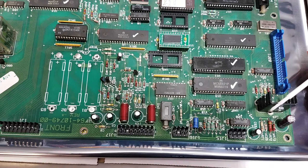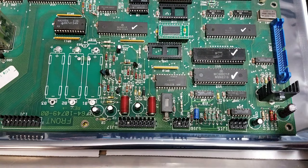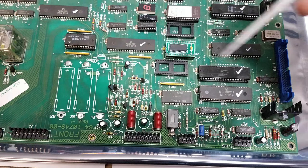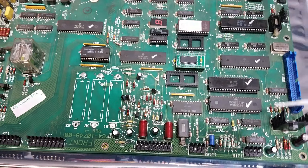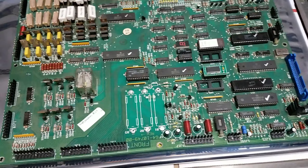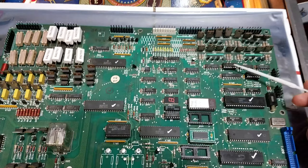Since I couldn't get Leon's sound test to run properly, I put a good sound PROM from Space Shuttle in and tested the sound section of this board in Space Shuttle — it worked fine. The general diagnosis for cross-connected boards says at least one PIA of the five will go bad, so I figured since the other four tested good, this one was likely the casualty. The 7447 also died — I'm assuming that was part of the cross-connection — and U41 died from a previous tech's findings. U56 was socketed too, though I'm not sure if that was from this incident.